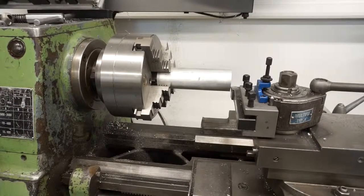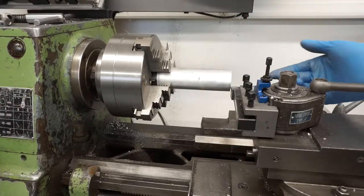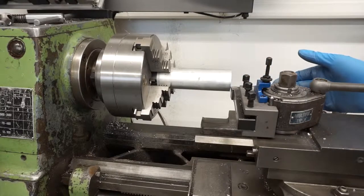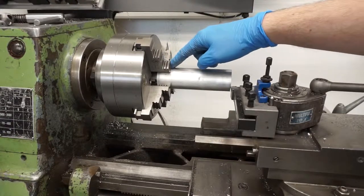The stick-out is a little longer than I'd like but it's no problem — I'll keep the cutting speed slow. Basically what I want to do now is some basic turning operations here and here, then drill it with 18mm and bring it up to size with a boring bar to make a nice fit to the holder. Afterwards I'm knurling it, and at the end I'll turn it around to drill from the other side for the BXA holder. That part will not be knurled because I have something different in mind — I want to add a feature for an additional holder, which may give more strength for larger threads.